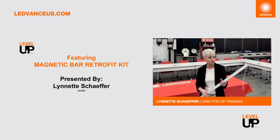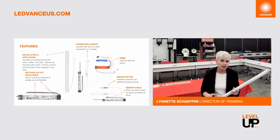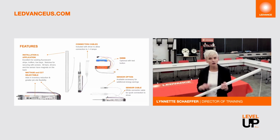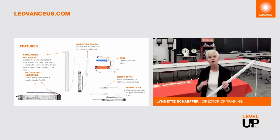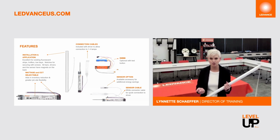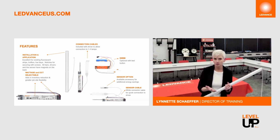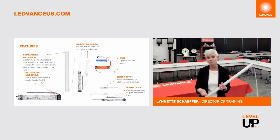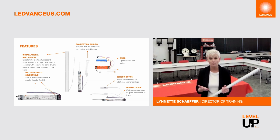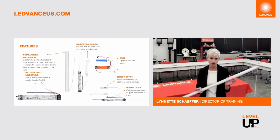And in this video, I'm going to be introducing you to LEDVANCE's Magnetic Bar Retrofit Kit. Before I get into the installation of this product, I wanted to talk a little bit about some key features. One of them is definitely application, and two, high-level installation. First of all, these are really great for fluorescent strips, fluorescent troffers, lay-ins, low bay fixtures, any of those type of fixtures that you want to upgrade from a fluorescent to an LED, and maybe you don't want to go to a brand new luminaire, or maybe you don't want to go to an LED replacement tube. This is a really good solution.